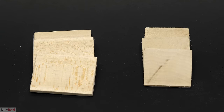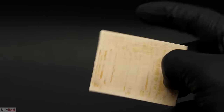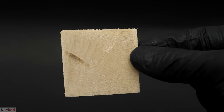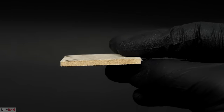The main difference with these cuts is the way the grain runs across them, and the paper had a good diagram of this. Wood naturally contains a system of narrow tubes which allow the tree to move water and nutrients, kind of like our blood vessels. The exact anatomy changes between hardwood and softwood and between species, but the only thing you really need to know is that these tubes do exist and they run in the same direction as the grain. For the lengthwise piece, the grain lines run from end to end, meaning the narrow tubes span the entire length and only open up on the ends. For the widthwise cuts, all the tubes were cut much shorter, with open ends on the large flat part - only about 3 to 4 millimeters in length.